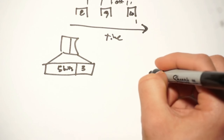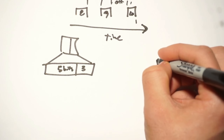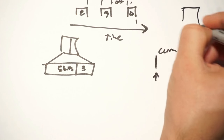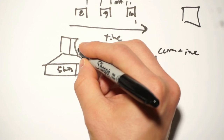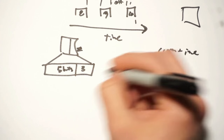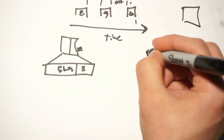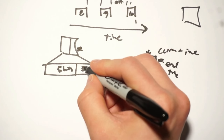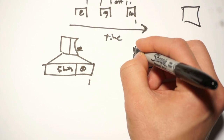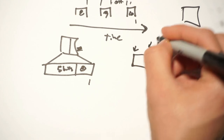What we can say is we can start at the end of time back here, and we can read a value. We can just read the current time, and we get that from the end of the packet, and then we'll go look at this packet right here. And so we know that this very first byte coming off the front is the end time. But we don't know when its start time is. So if it has a value here of 0, we know that the start time is the next edge. If it's a 1, then it's actually this next edge right here. So it would extend out. And if it is a 1, then, well, we have an unaccounted edge here.